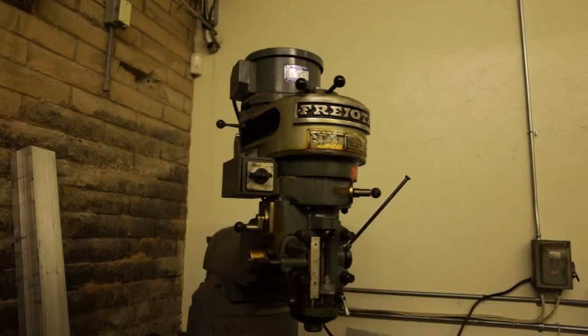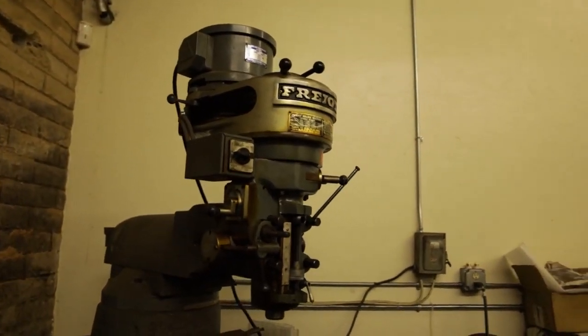We're going to get more into doing piston domes because there's a need for that. What we do is take a laser scan of a cylinder head combustion chamber, and that becomes the top of a piston. I can make a couple of adjustments for clearances so these things can operate at high RPM, and with a little bit of programming we can make an exact duplicate of that combustion chamber on the top of a piston to get maximum compression — because the guys we're building this for have pretty much all-out race cars.